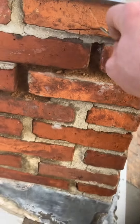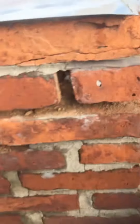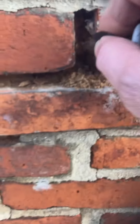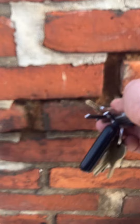I do think the main problem is this mortar here — the bricks are beginning to fall apart. That brick's still good, it's not totally disintegrating, but the mortar is the issue. This is probably the fireproof mortar if I had to guess. All the structure has leached away and this is wet — all wet.